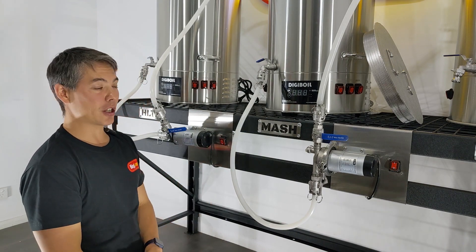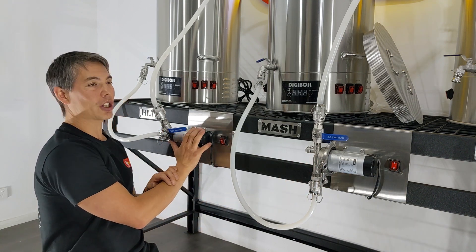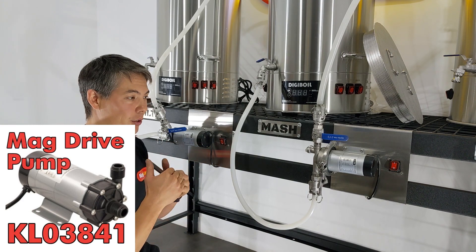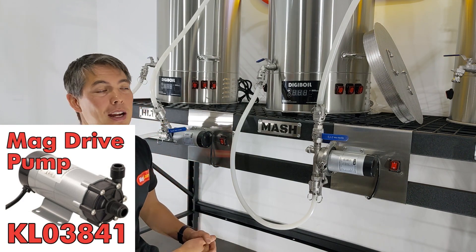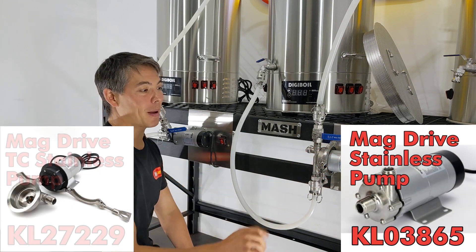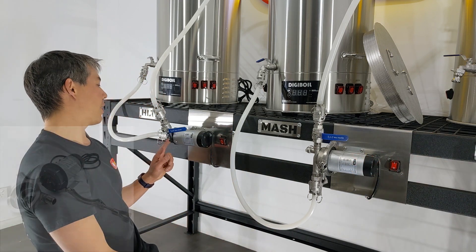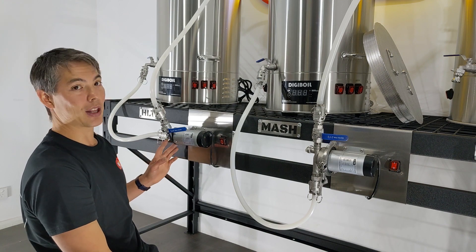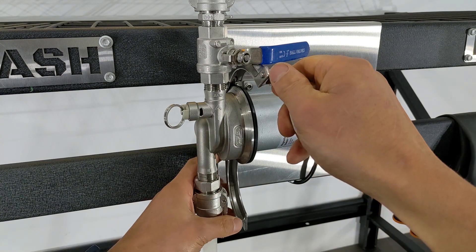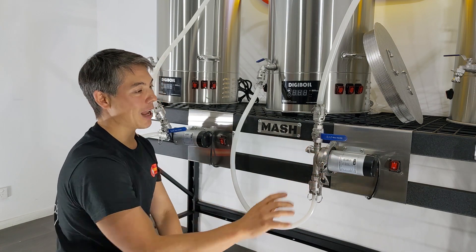The other thing I wanted to mention is you probably noticed we have two different pumps here. You can get the stock standard pump with the plastic pump head. We also have a stainless steel pump head for a medium price upgrade, or for the best upgrade, this tri-clover pump head makes it really easy to take apart the whole pump for cleaning. The standard one requires six screws to remove the pump head. With the tri-clover, I can just undo the tri-clover clamp and take the whole pump head off like that — that's a new product which just came into stock.